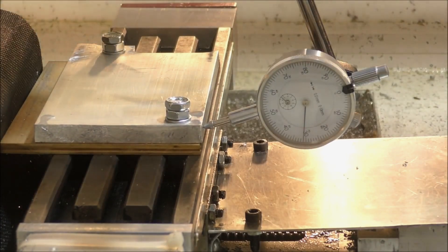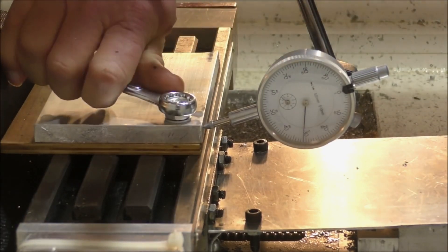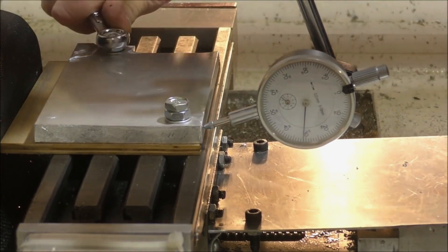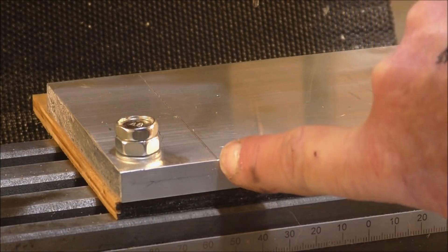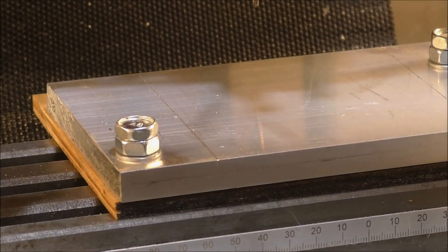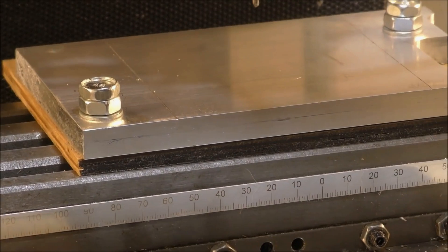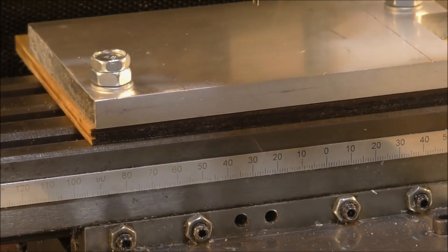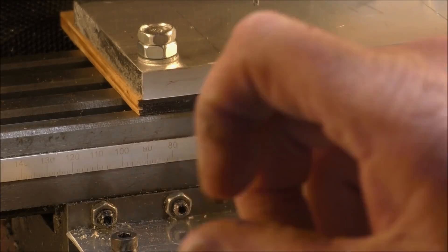That's good enough, that'll be just fine — so I can tighten that down. Okay, that's not going to move. At the start of the program, you can just about pick that mark up right there on that edge, right on that corner. So I'm going to set the zero-zero there, and then this is just a spot drilling program. I just wanted to be sure that that bolt wasn't going to hit anything.